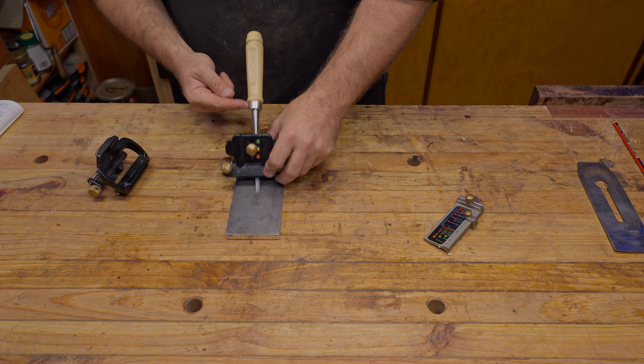Sometimes the blade can slide back and forward — in this case it doesn't — but with only this one big screw rather than the double screw, it can be harder to lock down nice and tight. With tapered sides, it sometimes only clamps on the top edge. You get the same issue with Eclipse-style jaws if chisels have tapers on the sides — side clamping doesn't work as well and chisels can slide. This one works well as long as you don't have tapered sides. For bevel-edge chisels where the bevel comes out very wide, it can be more difficult. With firmer chisels that are completely square on the sides, this holds well, but for firmer chisels I'd usually just use the parallel jaws.